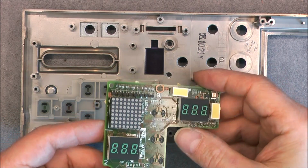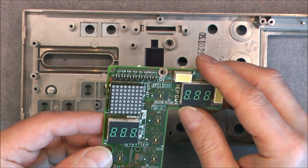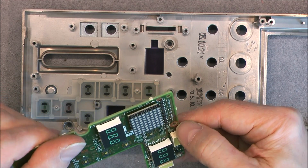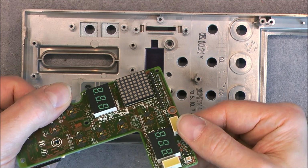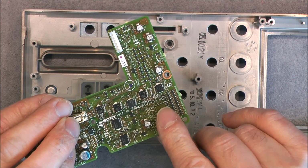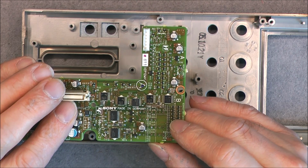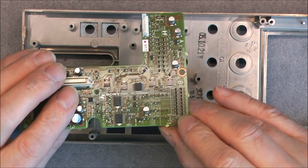Okay, I was hoping to find it in a socket, but no, obviously. However, it looks like this circuit board does not have metallized holes, and it looks like the solders are only on this side of the device here. So worst case scenario, if I want to just retrieve this display should be possible. A bunch of control transistors for it seems here.